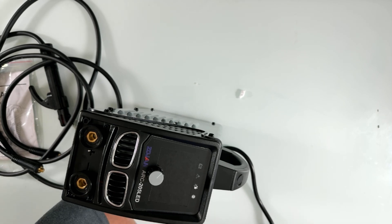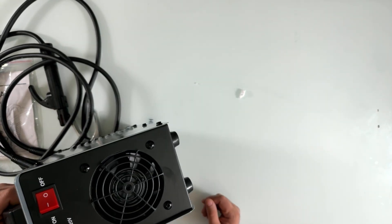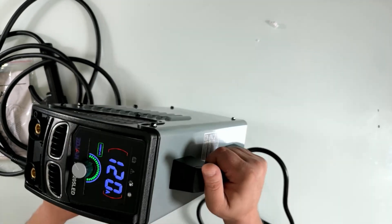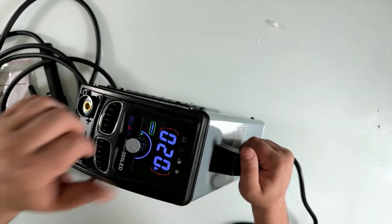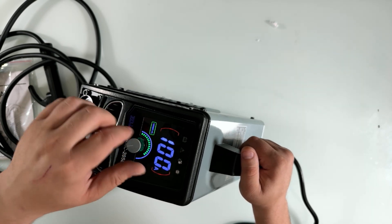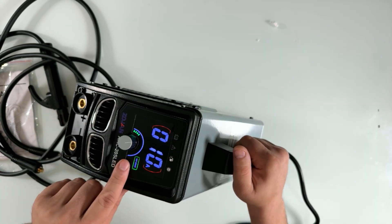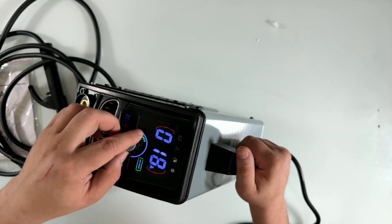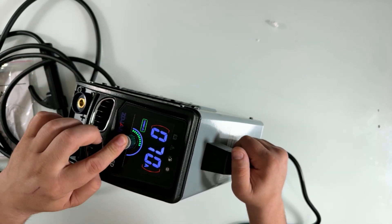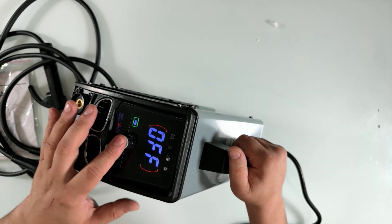Just like that — okay, and we have the power button on the back, big enough to flip with welding gloves. Boom — it says 120 amps. The lowest is 20 amps, so it goes from 20 to 120 on the 110V side. I'd probably set it around 70. You can also adjust hot start — that helps the rod strike easier. The fan has kicked in, which is really nice. It also has arc force and VRD settings.